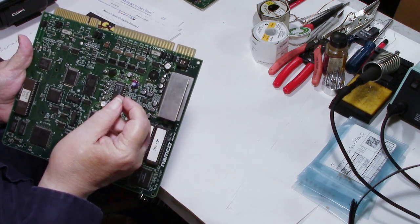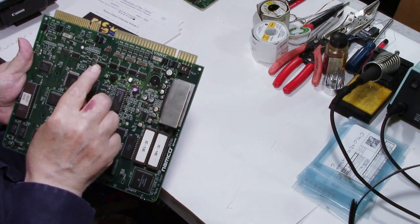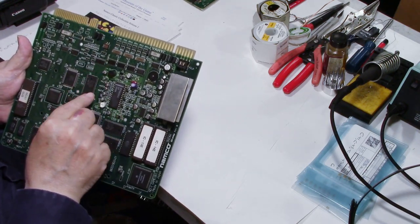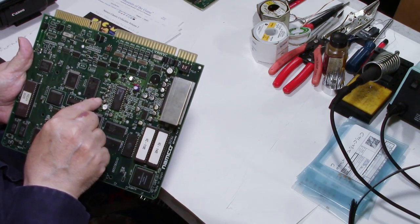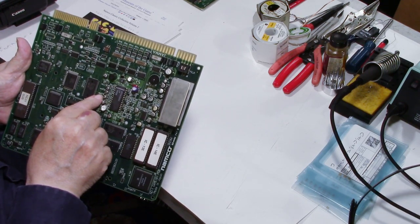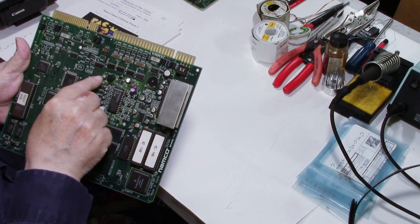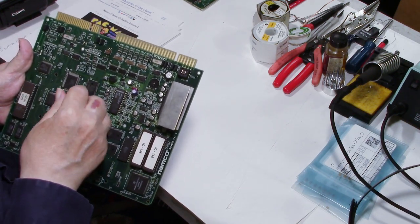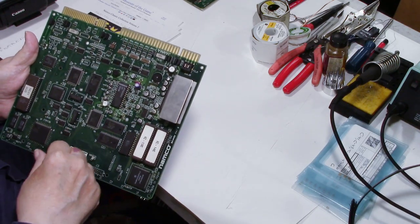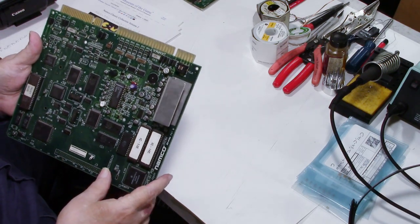I've actually seen people where they're heating stuff up, and even though it's not much force, you're still heating up all these other components, and the solder gets loose, and it's possible for you to blow these little resistors and other components off of the pad. So, and I don't have a hot air gun anyways. So,